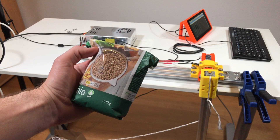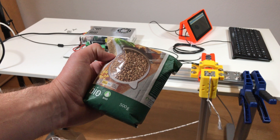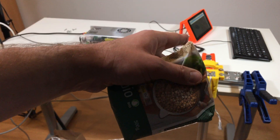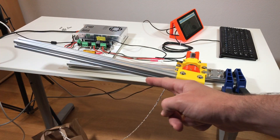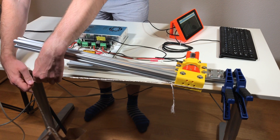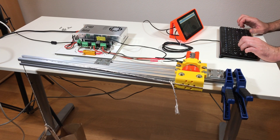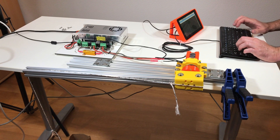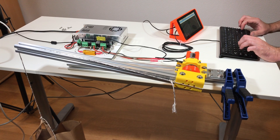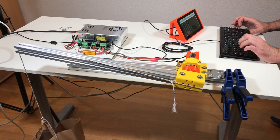I decided to add some other stuff to the payload in order to have a total payload of 2.46 kilograms, because this will correspond to a torque of 1.5 kilogram meter — which is the maximum torque allowed for this gearbox. This is a test of 1.5 kilogram meter torque with a payload of 2.46 kilograms. It holds. Let's go to set point 40,000 — still holds. Set point 45,000 — it does work! The motor is still cold and our drive is cold. This is success.